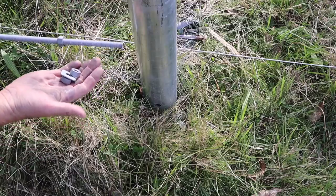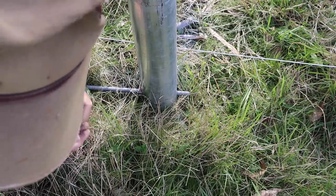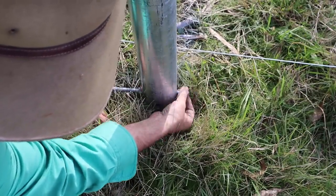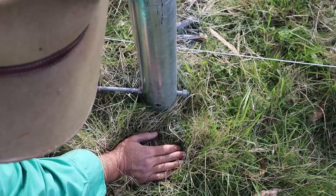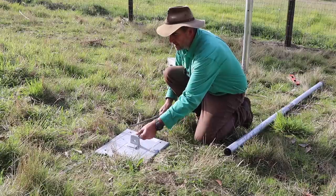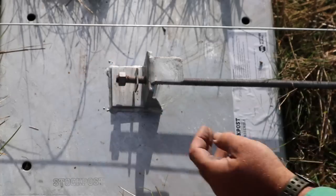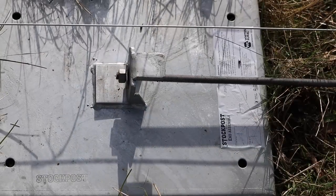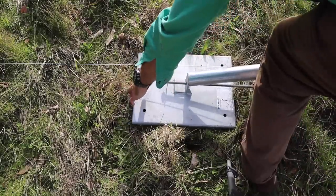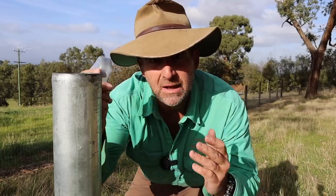The threaded rod comes with three nuts and a washer. Remove two of them and the washer, insert the threaded rod through the pre-drilled holes, and put one of the nuts on the other end. Don't leave too much hanging out in the gateway — pull it back and tighten up the inside nut. Next, put your ground plate in place up against your sighting wire, insert your threaded rod, and put on your last washer and nut — just put it on a little way so you've got plenty of adjustment for inserting your stay. Insert your stay pin into the post, put the other end of the stay into the tab on your block facing the post, then do up your nut and finish it off with a spanner until it's nice and tight. Lastly, put your cap back on the end post — this stops it filling with water; you might have to hit it on with a hammer.